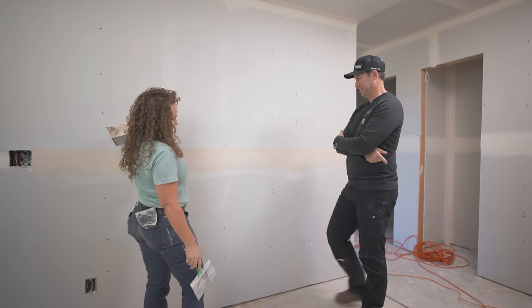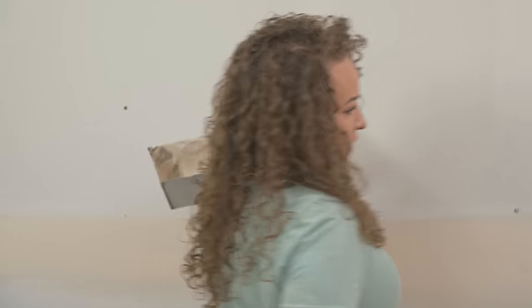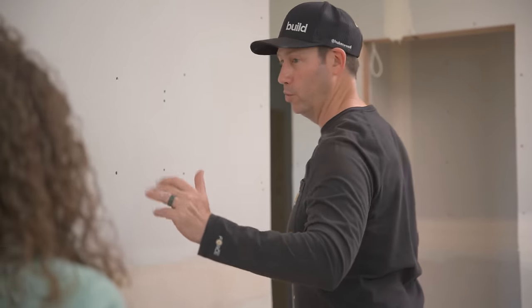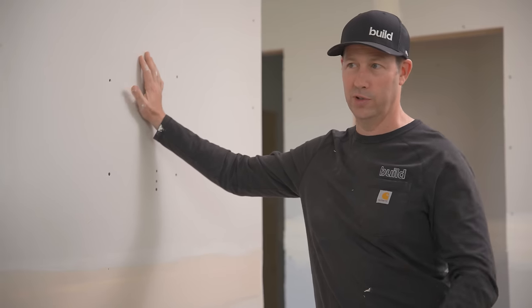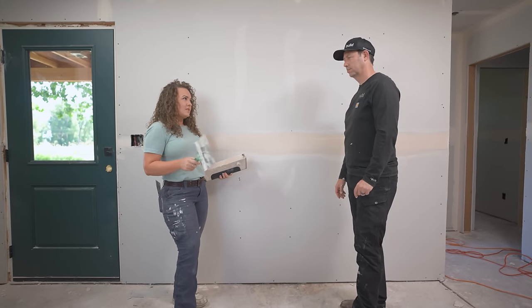I can even tell right now there's a little bit of a shoulder going on here — there's a secondary high point in the board. See how it's kind of light right there? Sometimes you have to come back and kind of split that out too, but it's a good first coat. How long did it take you to get to this place where — had we not been talking — you would have done this seam in less than a minute? Yeah, probably. Is that something that took you 10 years, or six months to two years? The dangerous thing about drywall is you can think you're good because you're better than what you started with. But to get really, really good, you can get there in about five to seven years — but that's kind of the dangerous spot because then you really think you're good and you quit learning. Like, I know everything and I'm ready to go off on my own. I've been in this trade for 20 years and I still learn stuff every day, which is one of the fun things I love about all kinds of construction — there's always something new to learn.